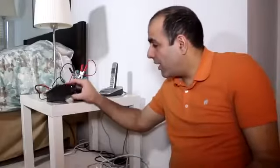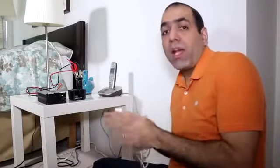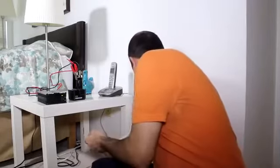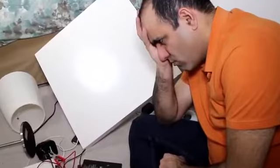I like to plug my inverter into the outlet of my house so I can power more things. And for that, I made this harness that you can plug to both sides. First, you plug it to the inverter. Anytime you connect a power harness, connect it to your load side first so you wouldn't short your power supply or shock yourself. I'm only human after all.